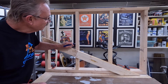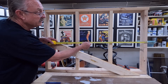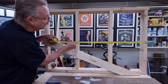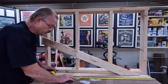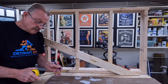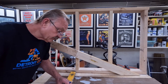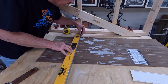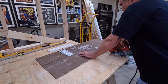With our level nice and level across here, we're going to go ahead and mark the tops of these other studs. This is the stud that we're going to land on right here, and what we want to do is mark this stud right in the middle. Then we go across our level line so that our tape measure is right where it needs to be and get our next measurement to the center mark, which would be 31 and three-quarters. If you're cutting paneling like this, it's important that you mark and cut from the back side to prevent tear-out.